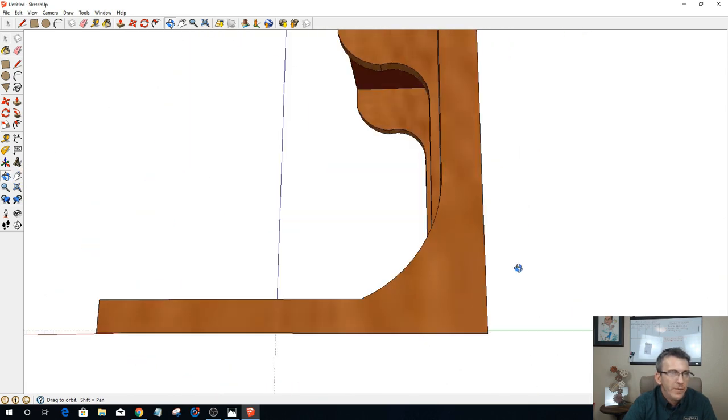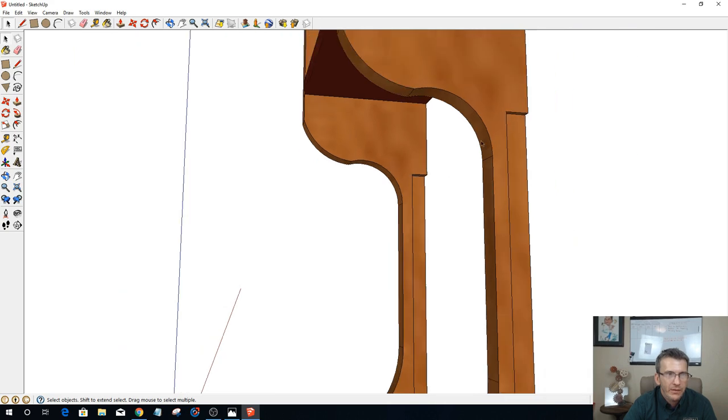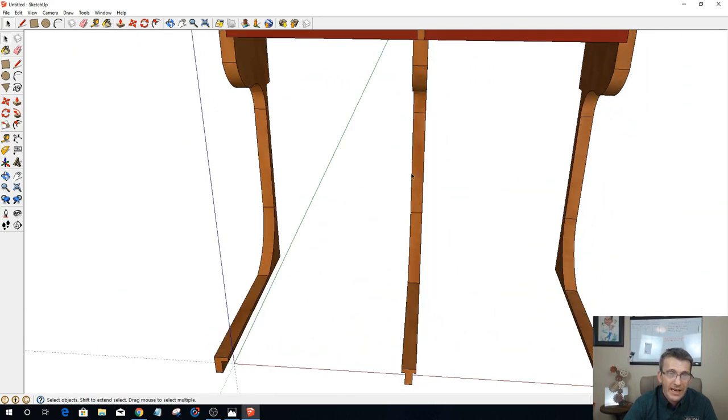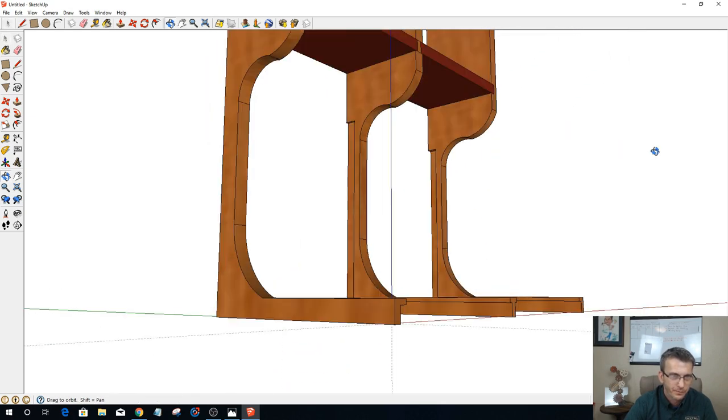Now, we're going to be carving this on a CNC. So in Vectric, when I create these rabbets back here, I'm going to have to do a fillet in the corners, so the corner of my back piece and bottom piece fit in. I'm going to have to cut my fillets appropriately on all my inside corners. And I don't mind having a small little fillet there for the assembly.